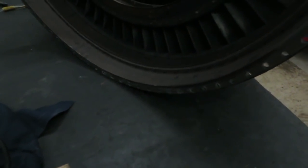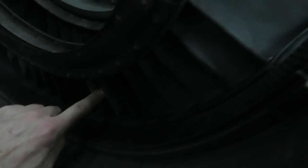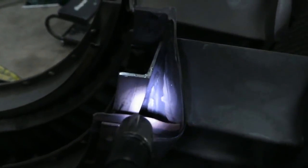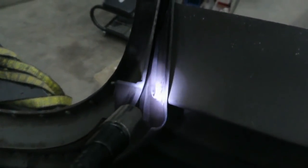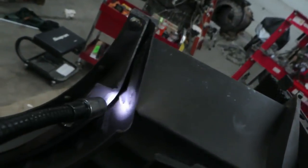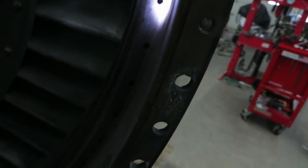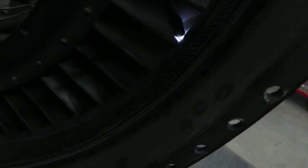We've got this out on the bench, so let's take a look. Here is the other side of the case — the space where the first stage nozzle goes, first stage blades, second stage nozzle, and third stage nozzle. The second stage nozzles are air-cooled; the air comes out through the top and leaks past the seal into the gas path. The third stage nozzles are not hollow — no air flows through them. Those little leakage holes allow the remainder of the cooling air to run up to the outer diameter of the second stage nozzles, and a little bit flows through them.